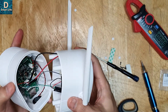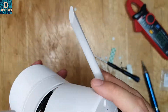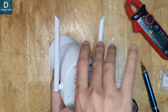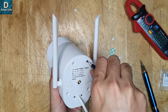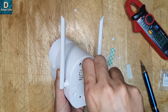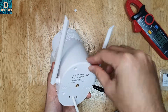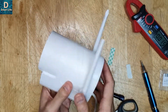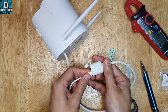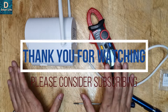Now we can close it all up. Make sure you line up properly and make the O-ring seal in the proper position. Since these don't have metal threads inside — it's just plastic — be very careful while closing it up. Rotate anti-clockwise and when you hear a click you can tighten it up, then click again and tighten. This avoids creating extra threads. Cover it up using the rubber pads to avoid water entry in the screw holes, and that's it. The camera is working — you can disconnect the power and it still works, and reconnect the power and it still works. This is basically independent — you can put it anywhere. Thank you for watching, please consider subscribing.